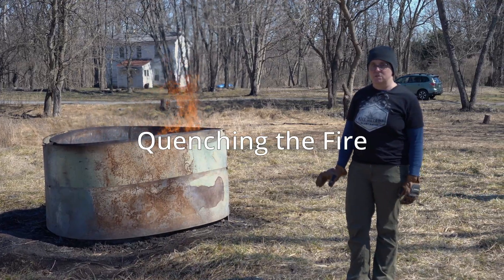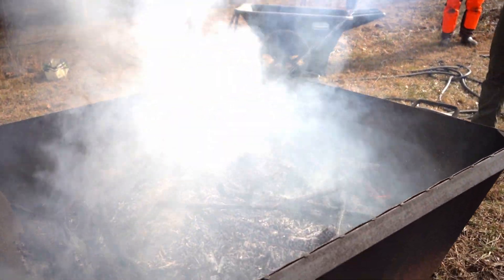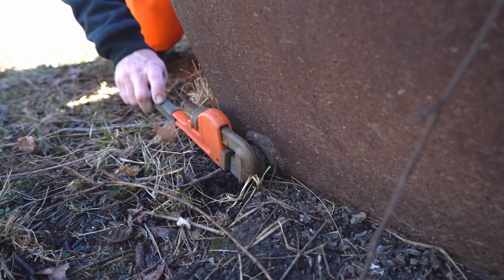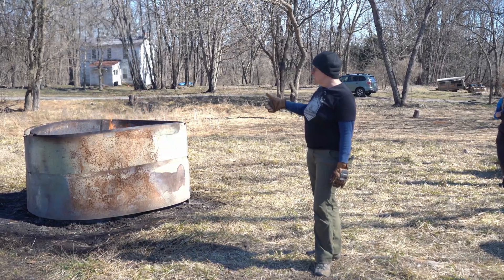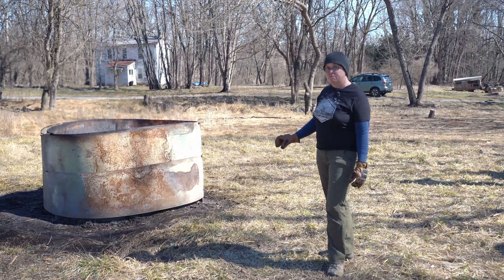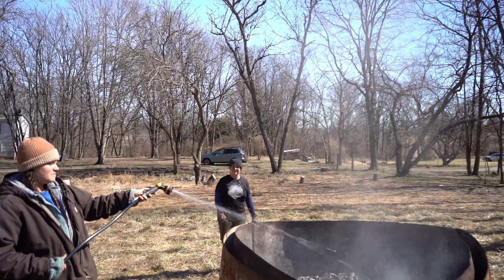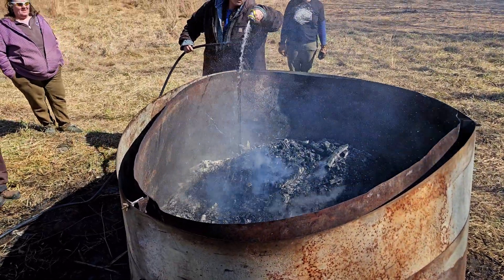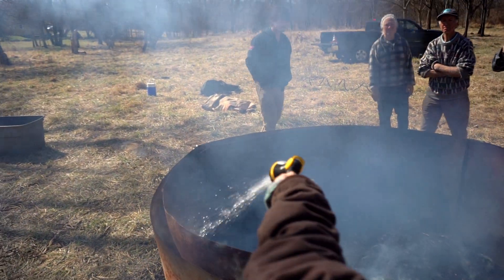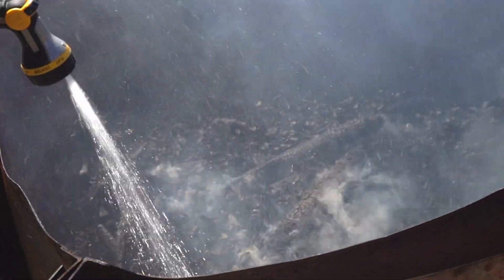We've worked with two different kiln systems — the square kiln with a closed bottom and this ring-of-fire kiln with an open bottom. The quenching part of the process is a little different for each. With the square kiln it has a drain plug — we filled it like a bathtub and then let the water drain out. With this one we're going to first put out the fire with the hose. As it starts to cool off we're going to take the panels off, rake out the coals, and spray down the charcoal more until it's fully quenched. On this size kiln we'll need about 150 gallons of water. You can also wet the side of the kiln to help cool it off. Anywhere you see white, hit that with the water.